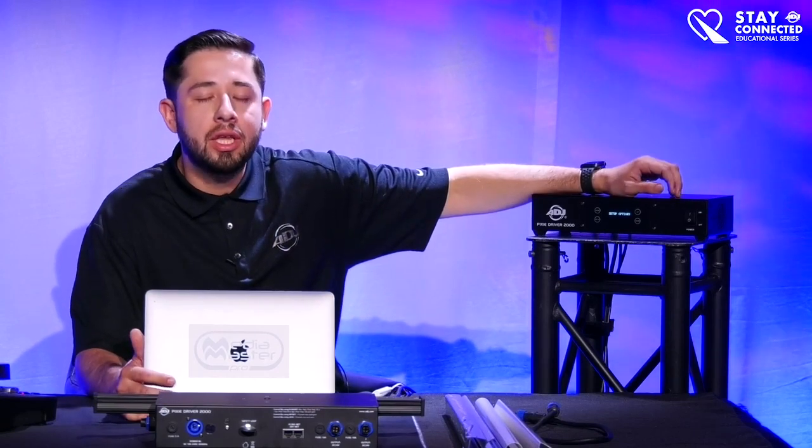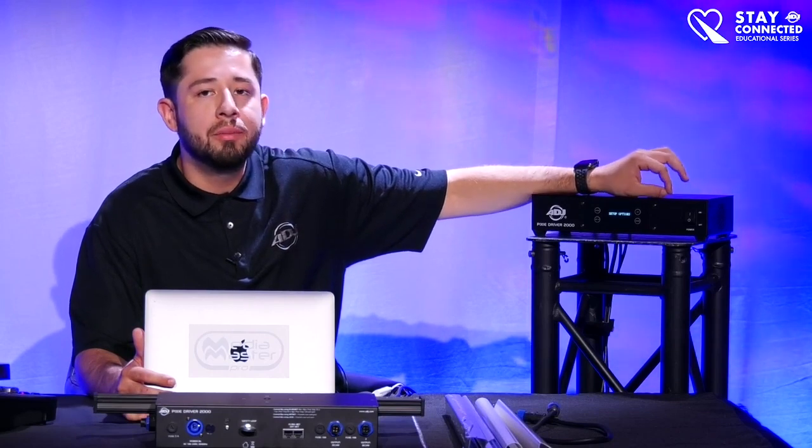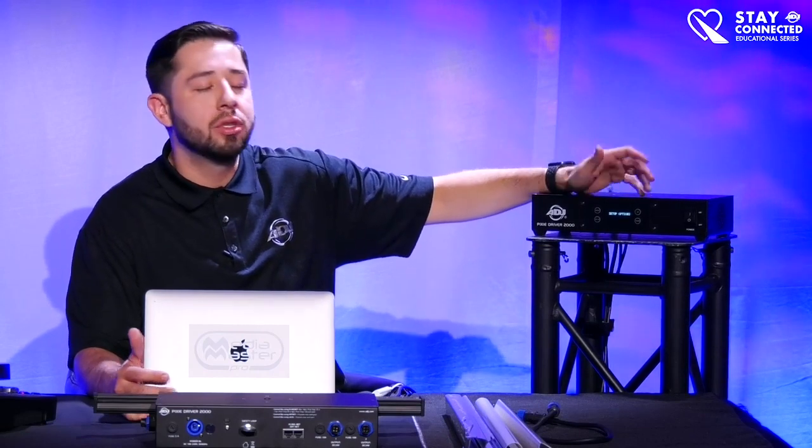So with the display that you guys saw, I did a various number of units on there. I think I have a total of 6 Pixie 30s, 4 Pixie Strip 60s, and 2 Pixie Strip 120s. So we're going to go ahead and now map those through Kling-Net. I'm going to set up the Pixie driver so that I can put in all the information regarding the Kling-Net and what we're going to be outputting through which port, how many units, and of course, through what protocol, which I just said, Kling-Net.